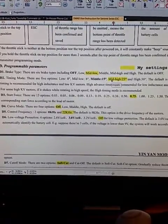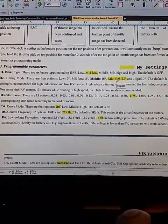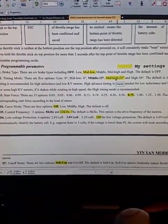And I found, instead of medium, if you set the timing mode to medium-high, you'll get a little bit more RPMs out of your motors — at least what it sounds like when I'm ramping it up and down in Betaflight.